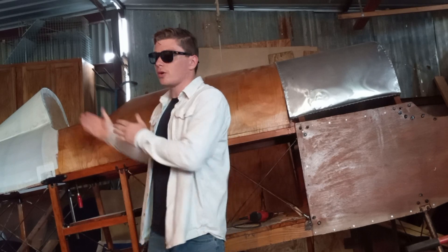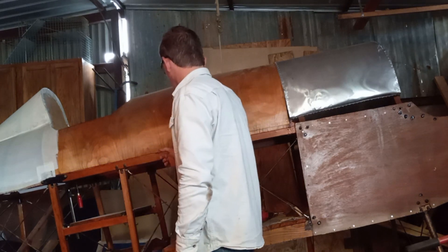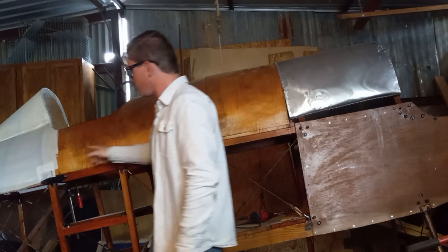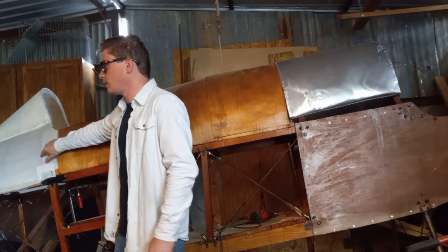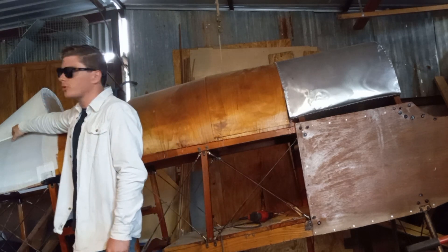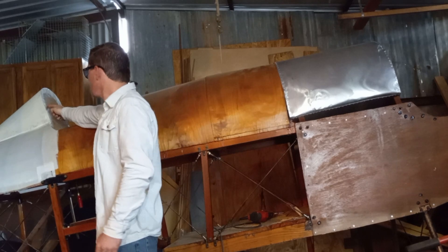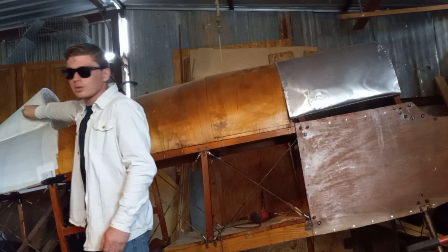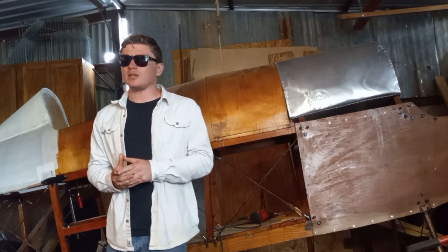The headrest is also a little bit different than how an original headrest would be, and the main reason is that I could only find plywood that was four feet wide, so the plywood part of my fuselage doesn't extend back quite as far as an original one would. On an original SE-5A the aluminum headrest would have screwed into plywood, but since I didn't have that option I epoxied it to the plywood and then covered the aluminum headrest with Dacron. It's actually really sturdy so I'm quite happy with how it turned out even though I had to improvise.